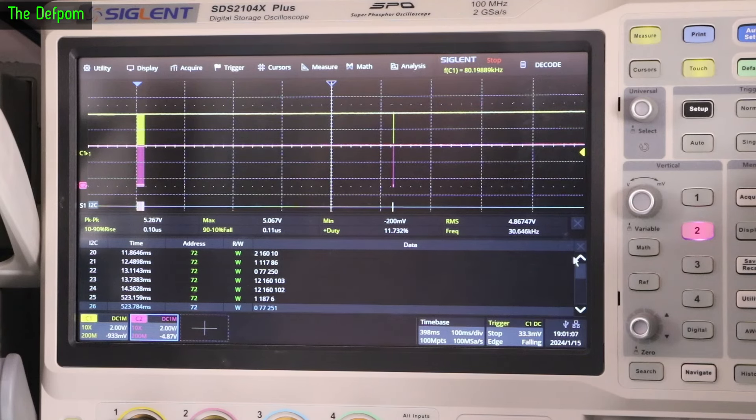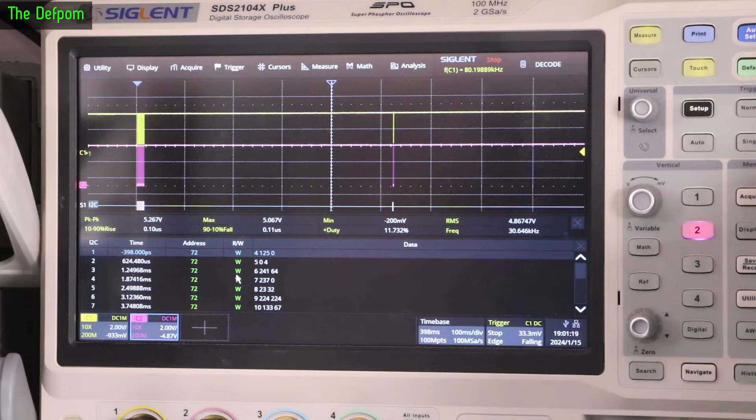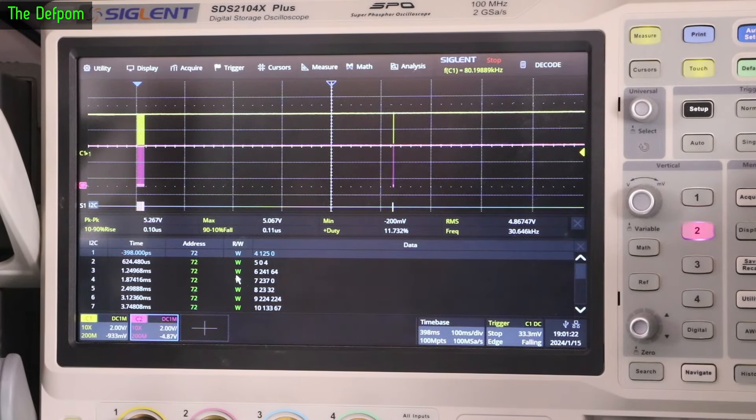I can read the data, but I need to figure out how to interpret it and decode it, since the data sheet doesn't say enough. It says bit 0 and 1 of the N divider, which is probably what I'm interested in — that's the encoder. I can capture the packet. The tricky thing is the delta tune: whether it changes by random values or not. I need to figure out how to do a 5 kHz offset, not just a channel jump, and whether delta tune will complicate that.